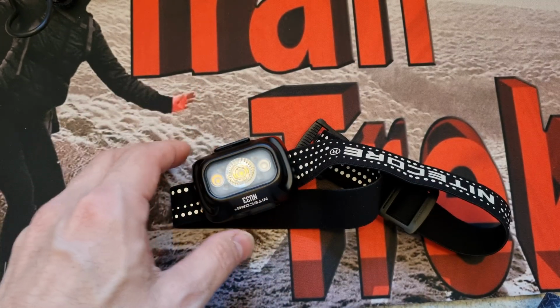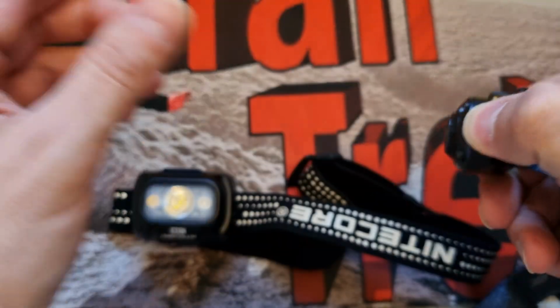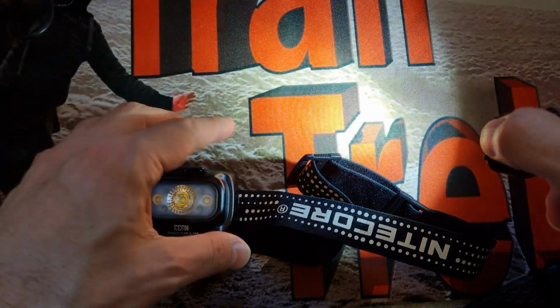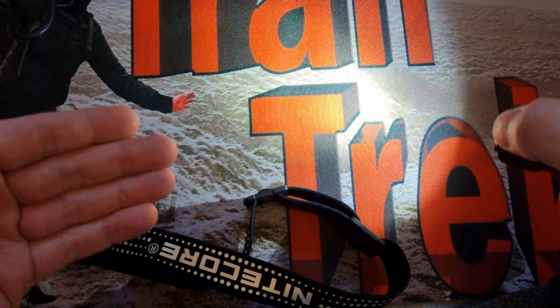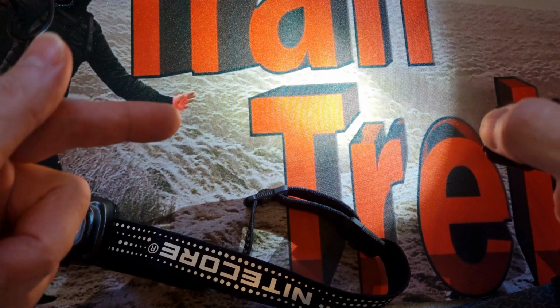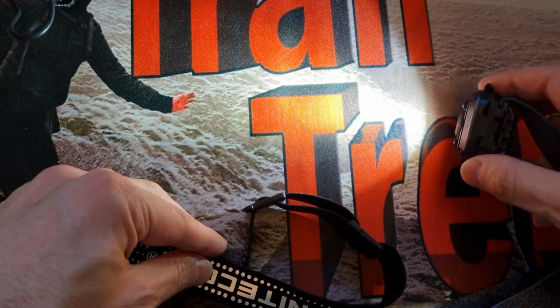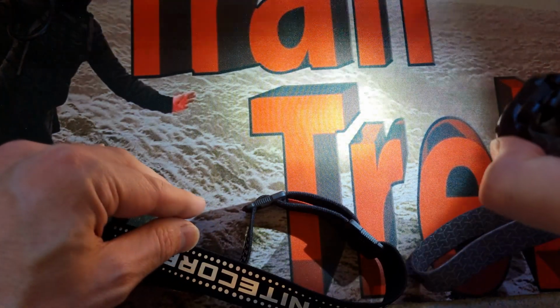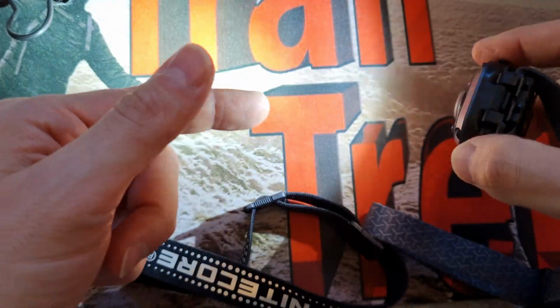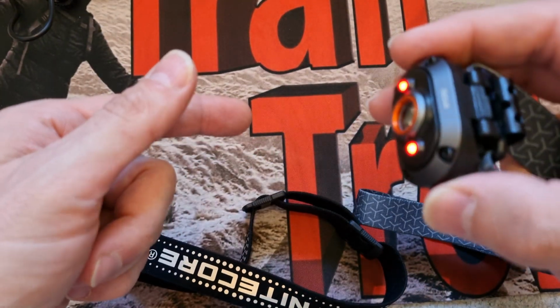I didn't find any pulse width modulation. Pulse width modulation is when you have a system that is turning on and off. I'll show you a terrible, if I can get this to work. Now, can you see it there? See that flickering? Now, I can hardly see that with the human eye. I can, but on this, it's very sensitive to it, so it's picking that up. So if I put this at certain angles, there, look at that flicker, awful. That's the Nebo Micro. They have fixed that on newer models. I'll give them that, fair enough. But it's awful to look at.